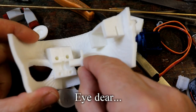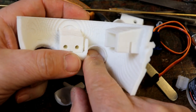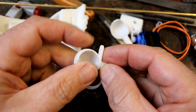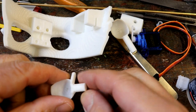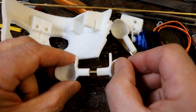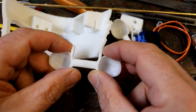So here's the idea. They're going to fit in here. I did think about using bearings, but we've done those experiments. I thought, well, if we can 3D print it and there's not too much friction, that'll be okay. So I've printed them both separately, and obviously I don't need to have this little lever on this one. I only need one lever on the right hand side, because the right hand side is where the servo motor is going. So currently I've printed them with a 3.2 millimeter printed hole, which, allowing for the printing, means that a little 3mm brass rod fits perfectly. And I thought I'd just, at this stage at least, glue two of them together, because I didn't know how far apart they'd be. And I thought I'd just like to leave it so I could adjust it and glue it in the right place.